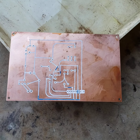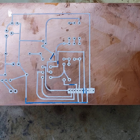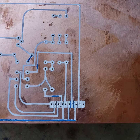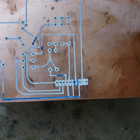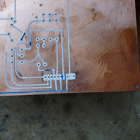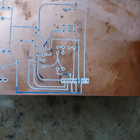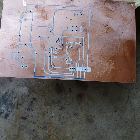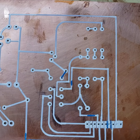We got the voltage control board inked up with the paint pens and it looks pretty shoddy, but it'll actually come out okay. We'll have to go back and touch up the cuts in between. The 0.1-inch header is pretty hard to do because you've only got 50 thou on either side of the hole, and that's really not a lot for human handwork. I'm not a professional engraver, so I'll have to go back over that with a sharp tool and clean out the space in between.